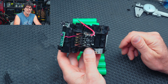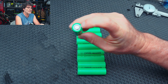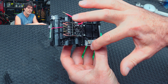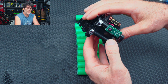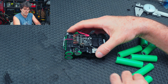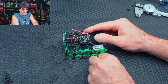The way these cells go in the pack is very easy — you don't even hardly have to remember. We've got our positive wire over here, so the positive side of the battery goes on this side — that's the one with the white circle, that's the positive side. So the two positives go here, it goes through, snakes around this way, and just zigzags back and forth, and you wind up with the negative here. Let's get our pieces together the right way so we don't get them upside down, starting with our positives. We just alternate every time. Very simple. Our negatives are going to be at the end.